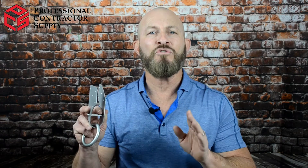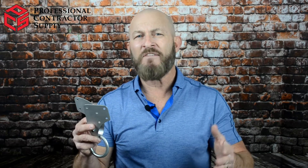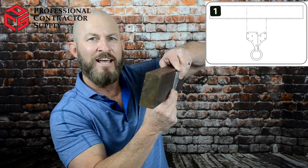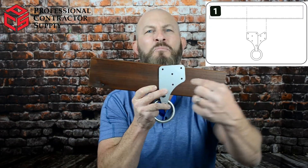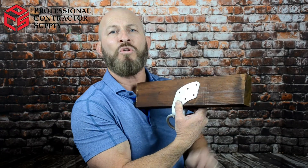Remember, it's incumbent upon the user to check the quality of the wood — no knots, no rot. Check for termite damage. If you have a hammer, go ahead and whack it a couple of times to make sure the wood is solid. Once you have it securely seated into the bottom of the truss like this, you will go ahead and pre-drill five holes in both sides of the anchor, for a total of ten holes.